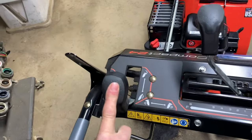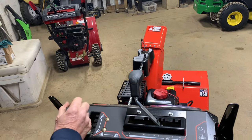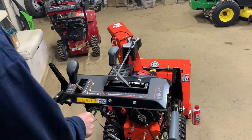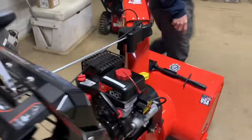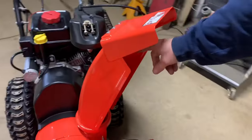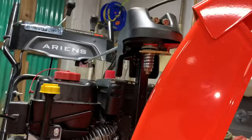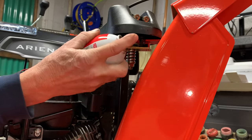Right here is your chute tilt — it's up and down — for where you're shooting the snow. Below that is your left and right on your chute. Now, you hear that? It's very stiff and not very happy. What I'd suggest is using silicone spray right here. Spray it in and around your chute and also your augers. I'm going to try to spray this up underneath where the gear is — these gears are probably plastic. Don't be afraid to just silicone everything up.